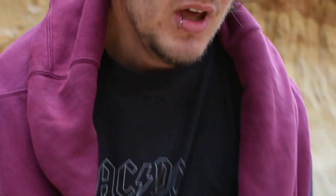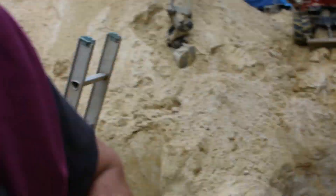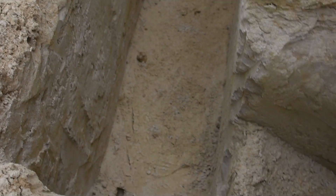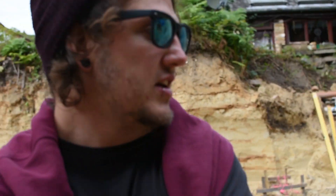The only part I've got to do now is bottom them all out — dig out the bottom bit. As you can see in the bottom, you've got all the lines of the teeth off the digger and little bits that need flattening. I just need to bottom it out, flatten it out, make it solid at the bottom — make it look like that one down here — so it's got a nice base for the concrete to sit on. There's a little bit of sand here and there that I've got to pull out in places where I couldn't get the digger back in.